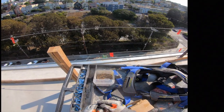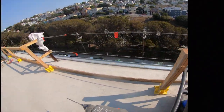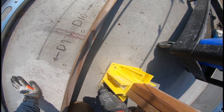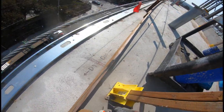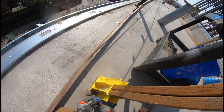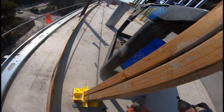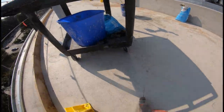After that, changing the bit on the impact, then grabbing the rotary hammer and just making a hole. From that hole, that's where I'm going to put the tap cons — just put them in nice and easy. It's just repetition. I repeat that process with the rest of the handrails.